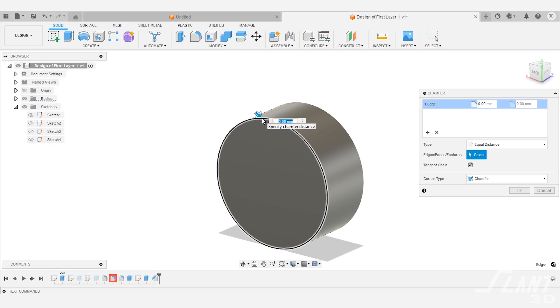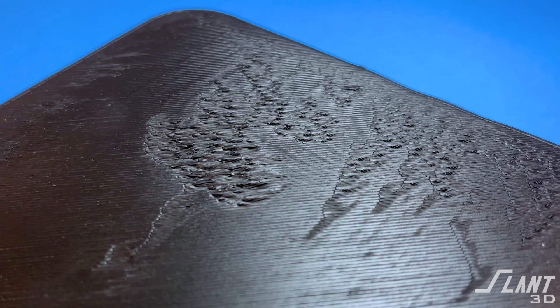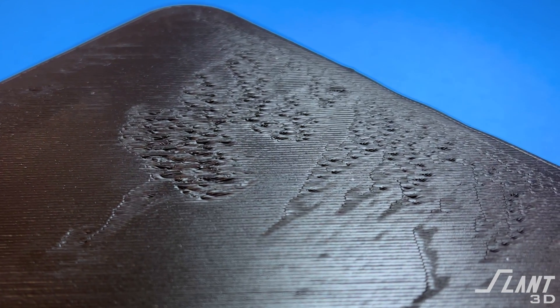This is a really nice first layer and you can see that the bottom is now uniform and very smooth, but the problem is with really large flat surfaces like that, you start running into another problem. As that first layer is pressed against the bed, depending on the materials and the design of the part, you can end up with these types of artifacts — basically small deformations from one line of material pressing up against another, not really a warp, but just a weirdness. In order to fix this issue, rather than having large broad surfaces on the base of the part, you can actually minimize them down.